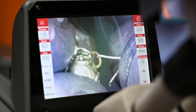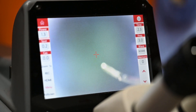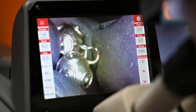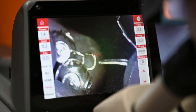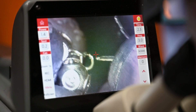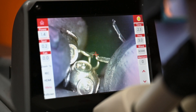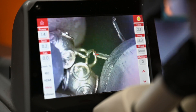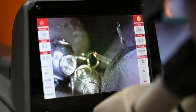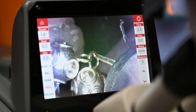Again, offering it sideways — it's not taking, so I'll increase that by one. When it's reflecting and shiny like that, you lose power in the laser. We could go back to the black marker pen and use that as a flux, or we could do it the way I'm doing it: I want to add some more material, so I'm adding the material first. Just increasing it a little bit more — it's being a bit stubborn, mainly because it's balled up — but it'll take. There you go.